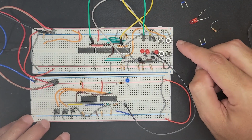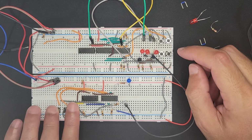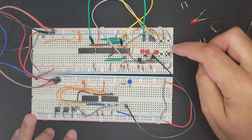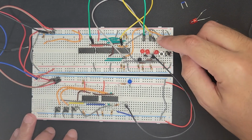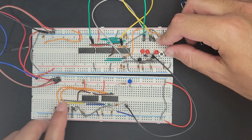Okay, so we have our operands here right now, and it's 0 0. So if we activate the instruction to add by 1 0 1, nothing happens. But if we put in some values, so let's say 1 0, which is 2, plus 0 1, which is 1, we should get 3, we should get 0 1 1 as soon as the instruction comes in.